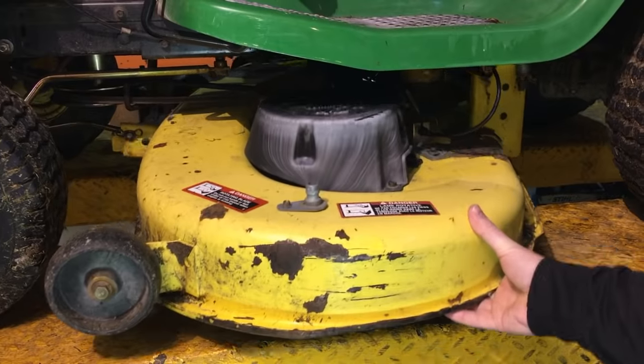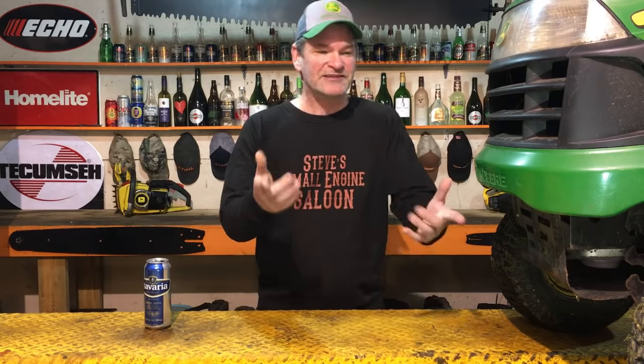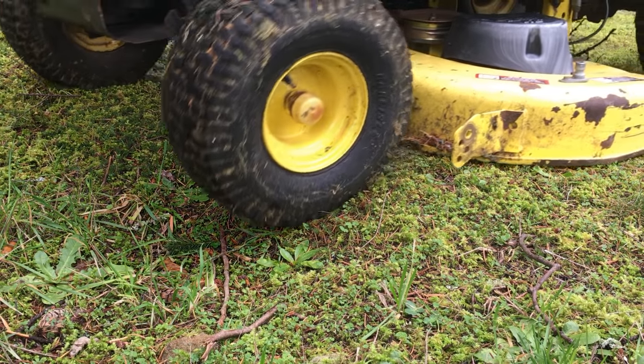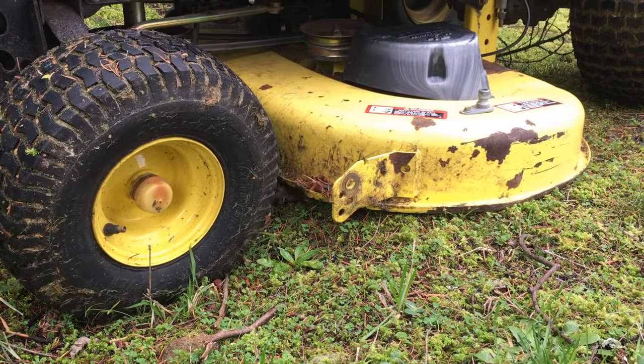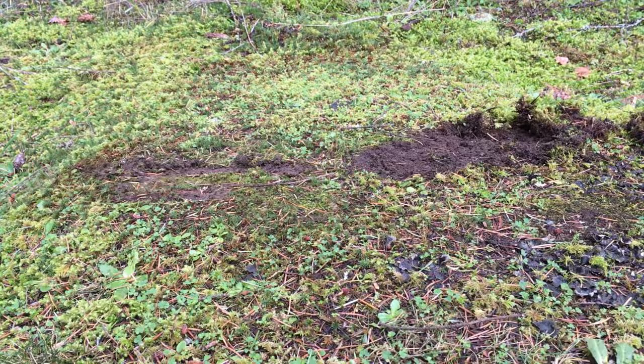They're free-hanging so when you're driving over stuff, it kind of floats around and moves a little bit with your riding lawnmower. What these things are actually for is to help — let's say you take your left wheel and you go down into a little dip, a little hole in your lawn. If you do that and there's no anti-scalp wheel there, the deck will come down and it'll actually scrape the top of your turf off right there — scalps it off. That's what those things are for. They're made as a bumper.